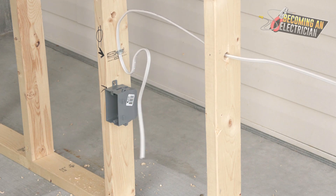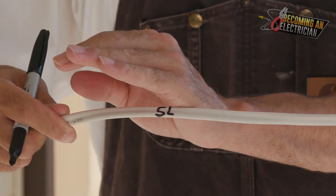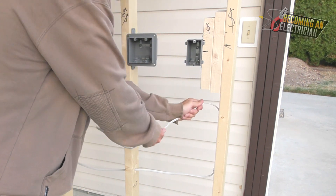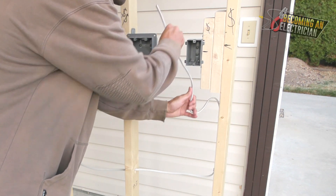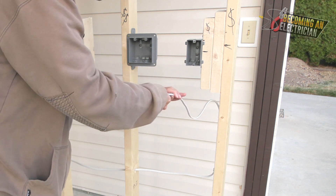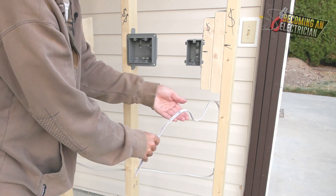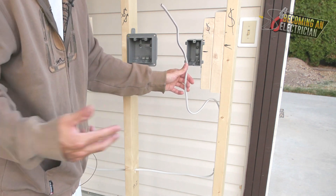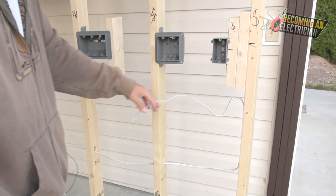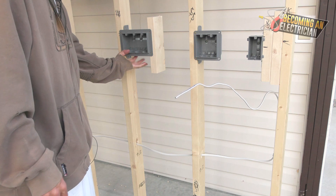When it comes to drilling your holes, make them fairly level — it makes pulling wire way easier. When labeling, label up a bit higher on the wire so you don't have to cut it off when you create your service loop. You strip from the service loop point downward, keeping your label intact. For a single switch it's not a big deal, but once you're at a two-gang or three-gang box with many wires, it gets more involved. Also remember to check your box fill — a 12-slot box doesn't mean you can put 12 wires in it.